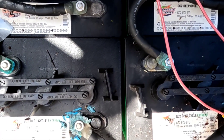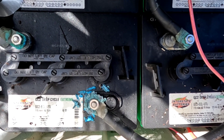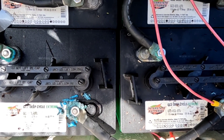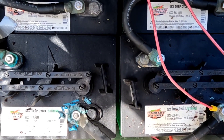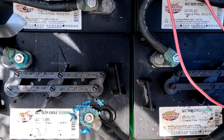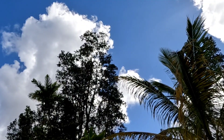What a mess. I'm gonna have to tear this lead-acid bank apart, sandpaper all those terminals and cables, and clean them up — takes a lot of time. I thought I would never do it again, but I'll do it one more time just to keep this bank going until it's completely dead, then get someone with a strong back to lift these things out. I just came out and filled them up with water a few weeks ago and they were all clean — and that happened within a few weeks of me not looking in here. Incredible and disgusting.